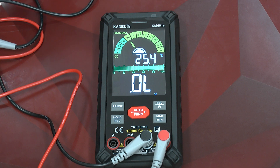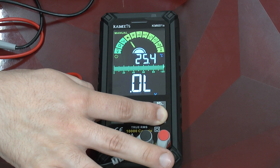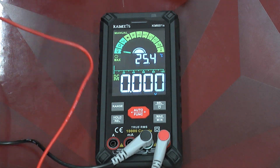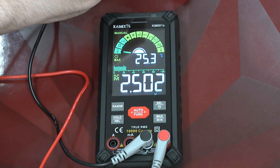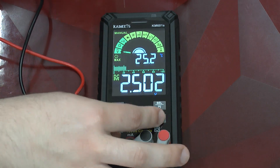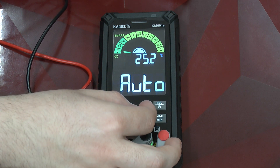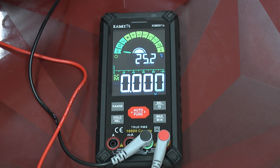We also have a max-min mode. Going into voltage mode first, then we push it, and now it keeps only the maximum. So if I go in here, now it remembers the maximum. And if I push here it remembers the minimum. By pushing max and min I can repeatedly iterate between these two values. Of course if you want to use it sensibly, you need to enable this max-min mode only once you've established the connection, because now it's measuring the open voltage of zero.